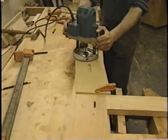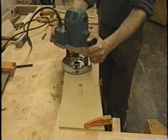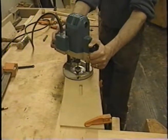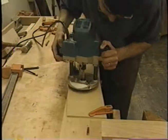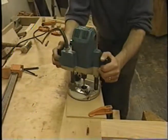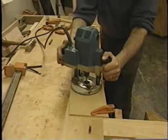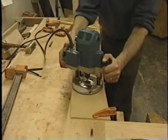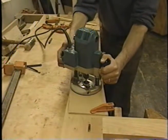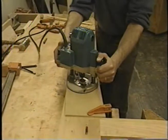These slats angle backward, and each one does so at its own angle. It's a comfort thing, and to find the best angles, I experimented with a mock-up. Then I made up this mortising template so I could duplicate the results. The router's fitted with a 5/8 inch guide bushing that just fits the cutouts in my template. The bottom of the template is registered to the top of the side rail. When I go to cut the other side of the chair, I just flop the template over, and the resulting mortises will line up perfectly.